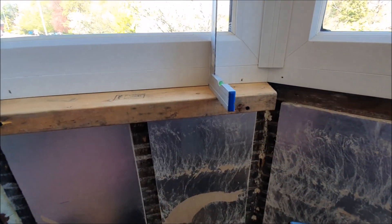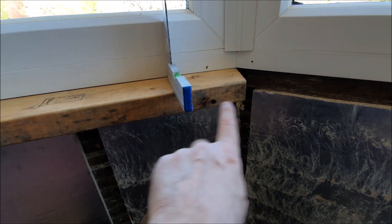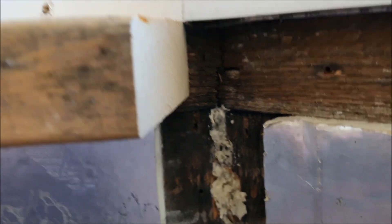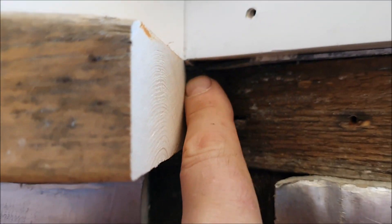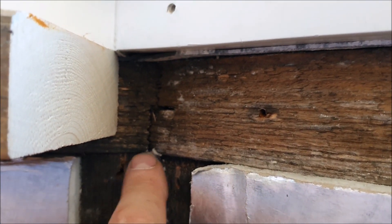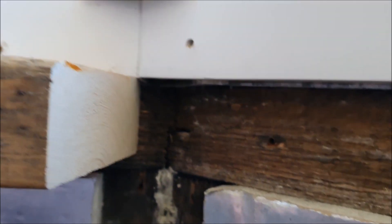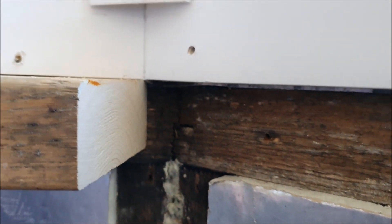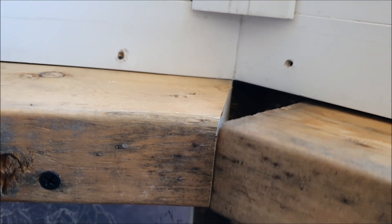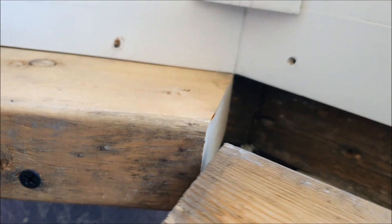That's the first piece. I've got my first piece in but it is only screwed in temporarily, because I want to just use it to mark up the second piece. There is a little bit of an anomaly — the angle of the window frame doesn't match the angle of the stud. That comes over this way a little bit more, and that could create an issue, but it shouldn't be too much of a problem. So what I've got to do is when I mark this next piece up, I've got to mark it there but also cut a notch out of the back corner so it fits in.